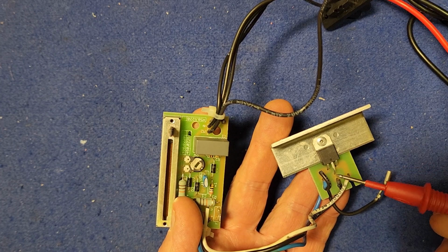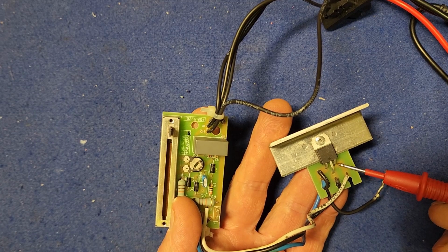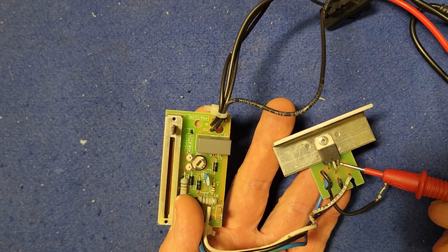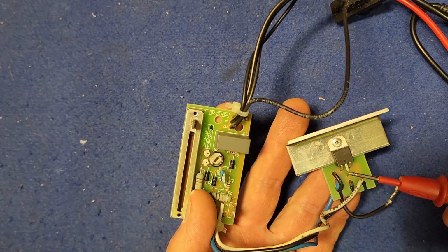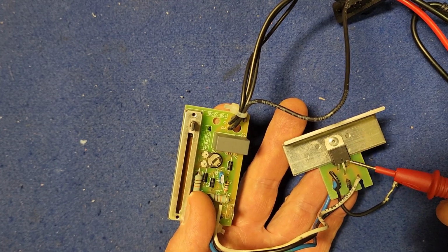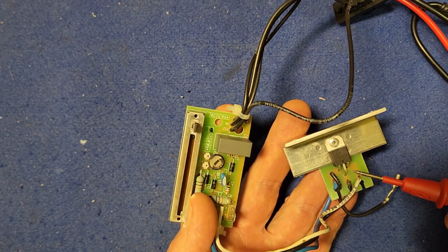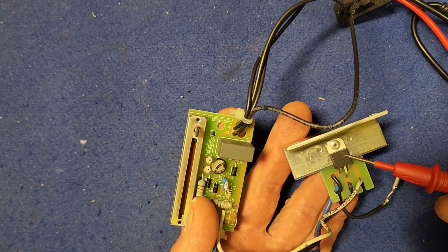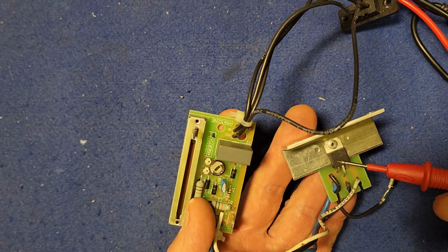So you have two terminals which allow the AC voltage to travel through, and it's turned on by a gate, which is a special signal voltage to turn it on. So it can handle much higher current than perhaps another smaller switch in a similar situation, and it can be controlled via the gate. That appears to test out fine. I've checked Google and I've tested the terminals, and it seems to be responding exactly how it should. Plus, if that was either shorted or open circuit or something, our motor wouldn't work at all. So I'm confident that the triac's okay.